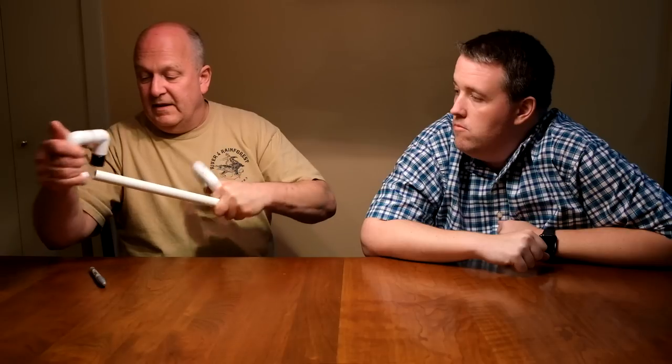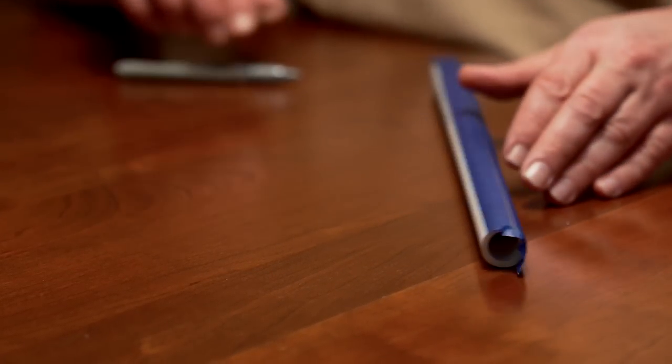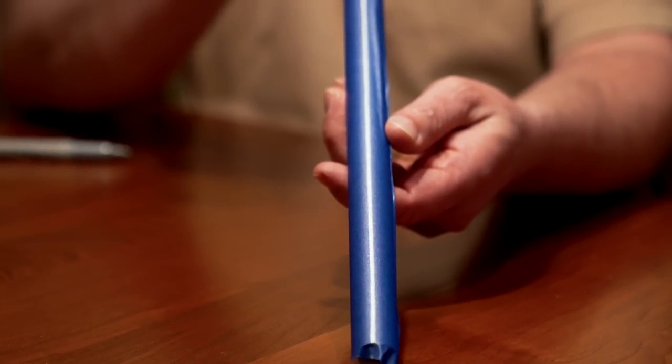For the holes, I'll show you a really easy way of getting those holes in a straight line — that's one of the things that causes people most grief. So you take your piece of PVC, take a piece of tape the same length, and lay the tape on. I like to use the blue tape. You want a straight line, so you lay the PVC down on the table and take your Sharpie. You just slide it on the table like this, and there you've got a straight line down the PVC. I don't know why I've never done that — that makes it way easier.